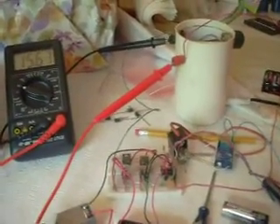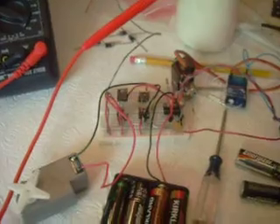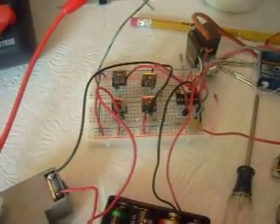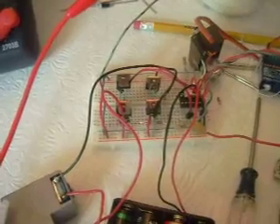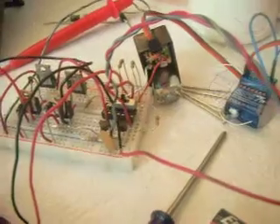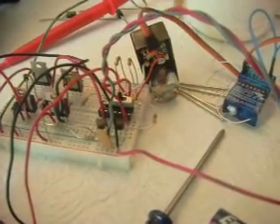This is a quick demonstration of my DIY servo driver. There's the main driver board with the H-bridge on it. Over here is a hacked-up servo — I just disconnected the motor leads and hooked them into the input of the H-bridge.